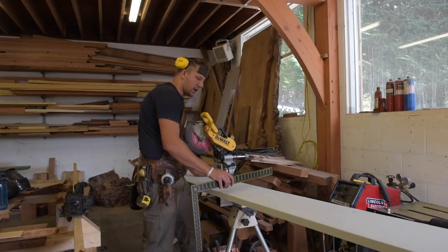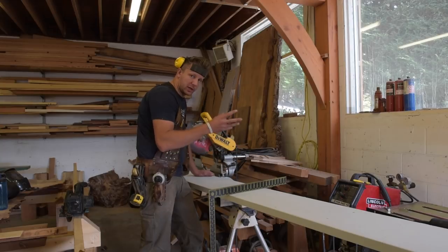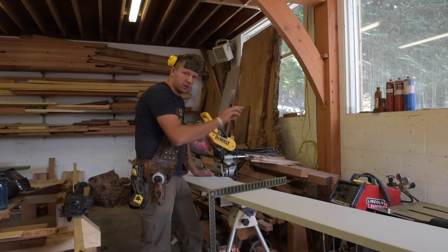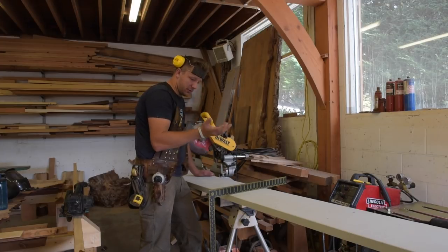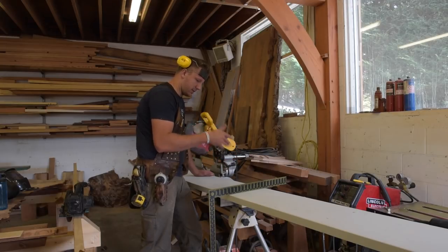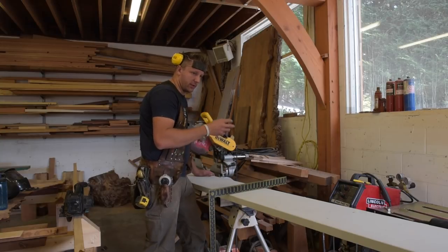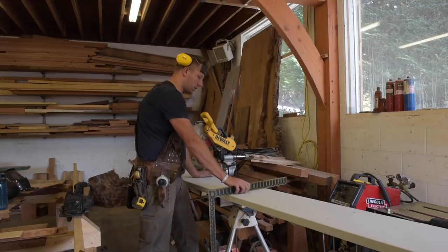I had to go through the whole pile at Lumber World. At Lumber World, they keep them in bunks inside a warehouse so that they're dry, standing up vertical, a lot easier to sort through the pile and pick out some good ones. So that's why I use Lumber World, just because I find they take better care of their materials, and in the end, that saves you a ton of time when you're installing it, not having to deal with bows and twists and warps and stuff, because that can suck up a lot of time.